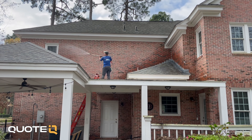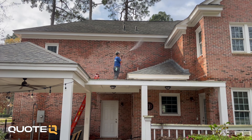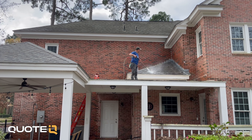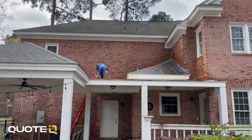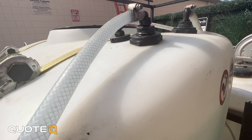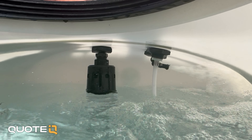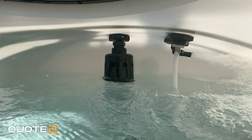Flow rate is important for multiple reasons, but the first is cooling down your pump. If you starve a pump of water, bad things can happen internally — the parts get hot, and catastrophic failure will occur. So you don't want to starve your pump of water. Pretty much any machine under five gallons per minute comes from the manufacturer with a water hose connection, because constant water flow is needed to not overheat the machine. On bigger machines, there is a bypass on the unloader that most people plumb back into the bigger tank to recycle and cool that water. When the trigger isn't being pulled, other machines just recirculate, but that water can get super hot, super fast — which is why you never want to leave the machine on when you're not using it for an extended period of time.